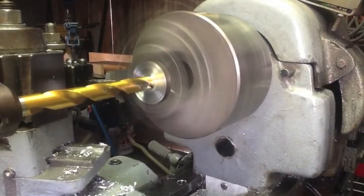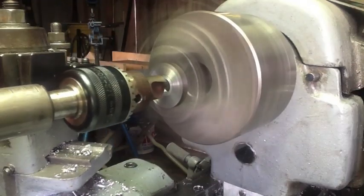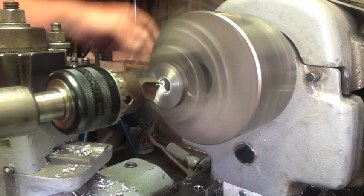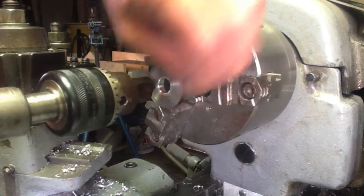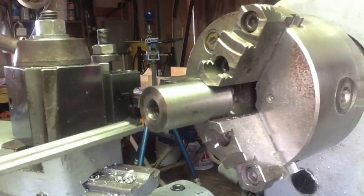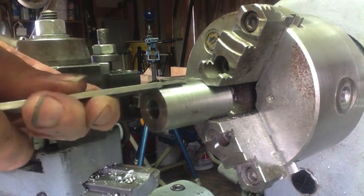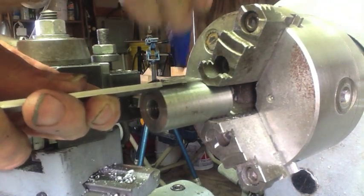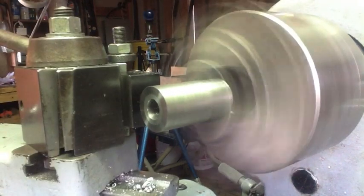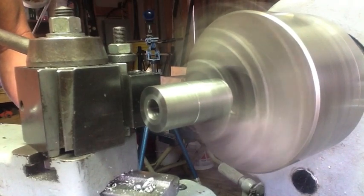The facing operation turned up a nasty burr on the aluminum bushing, so I drill it out and put a nice chamfer on it for a finished look. When I drill the hole for the handle, I want to make sure I don't intersect the center hole, so I take a measurement and transfer it to the outside using a threading tool, putting a permanent mark that defines my safe zone for drilling later.